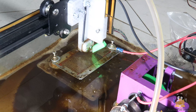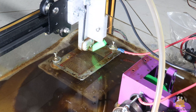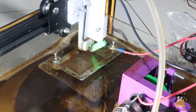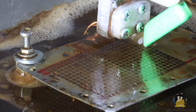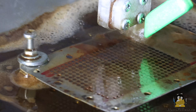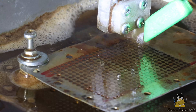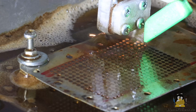There is no need to implement a nanofilter or monitor the conductivity of the fluid — sometimes less is more. But I will definitely install a coarse filter in the water circuit, as large particles lead to equally large deviations. The fact that the workpiece is not completely submerged and that the water jet blows atmospheric oxygen into the spark gap is also suboptimal, but simplifies the overall design.